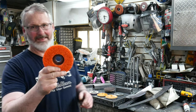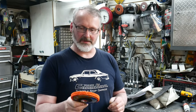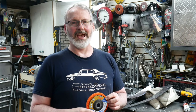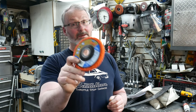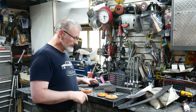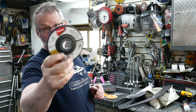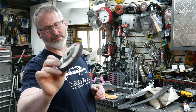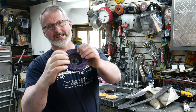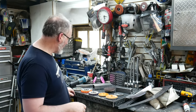Let's quickly review what products are going to be in the Throttle Stop Garage shootout. First up, this is a Norton Blaze. I wandered into my local welding store the day before yesterday and said, hey, what do you guys use for getting rid of mill scale? The guy said these work great. So I bought a couple — $15 a piece. I also have the purple ones — these are from Makita. I think 3M probably makes these because I have other 3M that's about the same. It's actually a little bit more dense than the orange Blaze, which is listed as extra coarse.